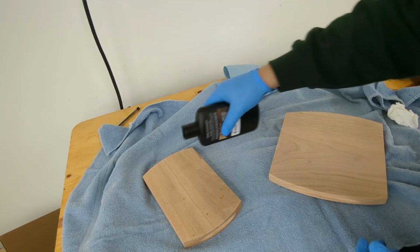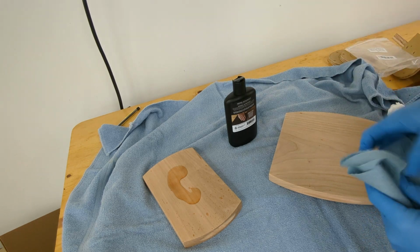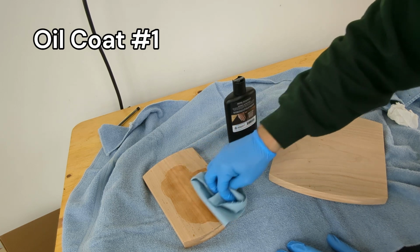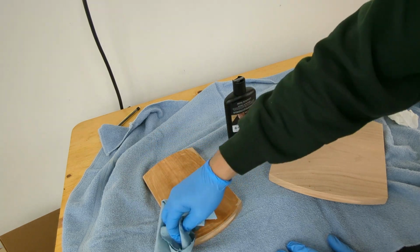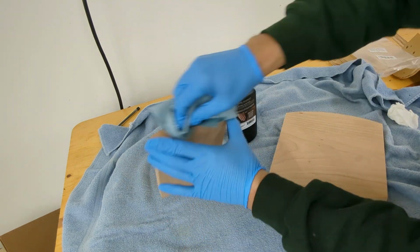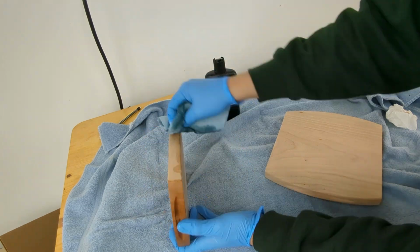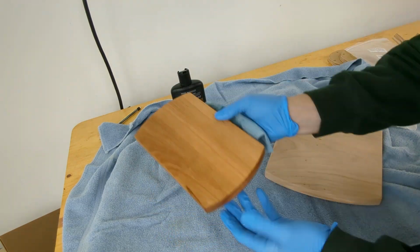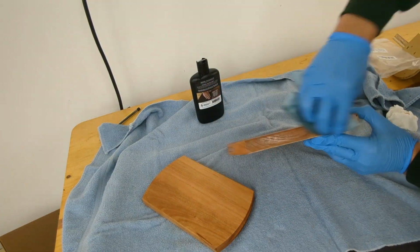I am using walrus oil and wax for these boards. The stuff is fairly expensive in small quantities, but I know it's good stuff to use for this application. I'll leave a link in the description for the oil and wax kit I bought, as well as other products used in this build. When I oil, I like to hit the end grain twice on the first coat since it will soak it all up. I did a pretty heavy first and second coat, a lighter third coat, and then one heavy coat of wax following the instructions.